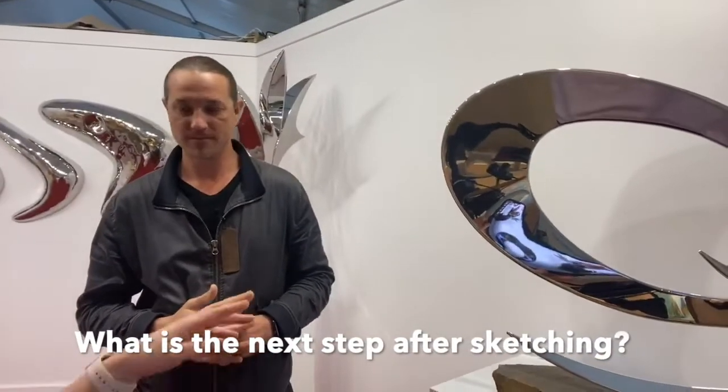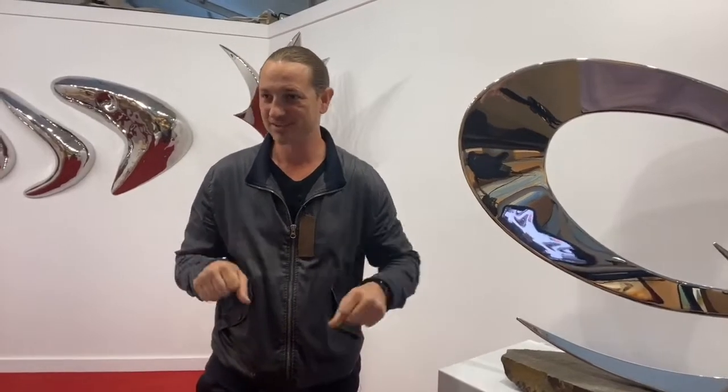Describing his process from napkin sketch to metal: he uses an overhead projector — old school — and traces his pieces proportionally onto a larger piece of metal, then freehand cuts everything out with a four-and-a-half-inch grinder using clamps, straps, and tension. He also uses old-school wood clamps.